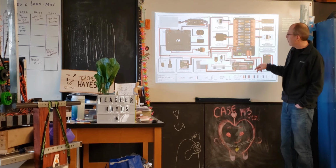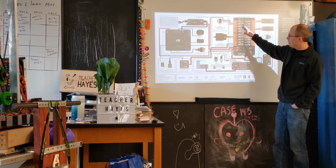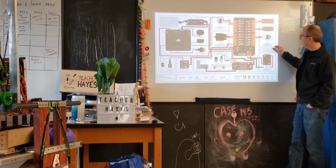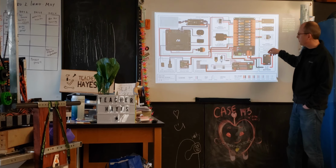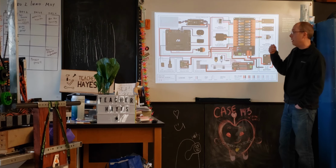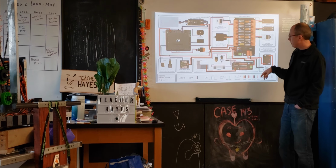when we distribute power. Power goes from each of these different fused outputs to a variety of different devices on the robot. You can see here, there could be motor controllers, right? Here's a SparkMax. You're used to seeing that on our robots. It can also go, in some cases, directly to motors, Falcon, for example. It could go out of these fused ones to power, say, a Neo separate from a SparkMax as well, in some cases, depending on what type of components that you purchase.